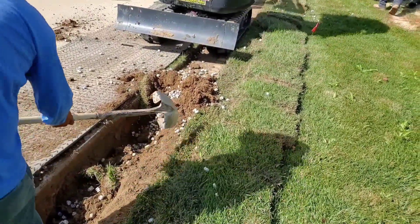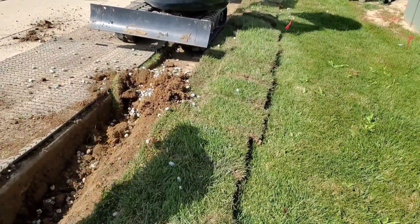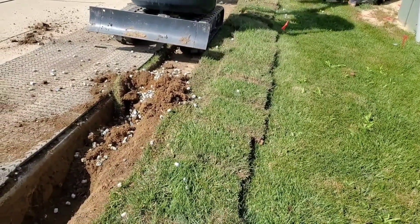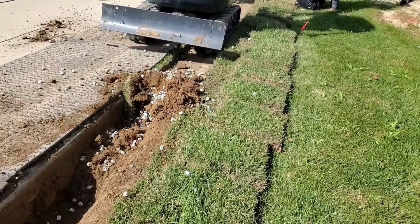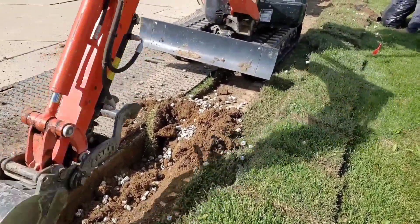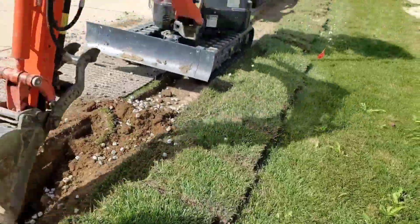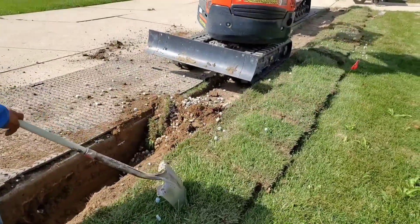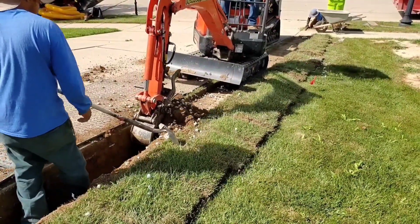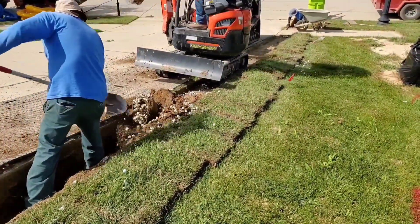We are replacing one of those peanut pipe styrofoam french drains. The homeowner had somebody put in catch basins with peanut pipe and it failed. I just wanted to explain a little bit why this failed - this was not the right product for this particular install. We don't use styrofoam peanut pipe no matter what. We believe in a real french drain, a true french drain, and that's gravel. What happens is when you put dirt on top of a styrofoam french drain, the weight of the dirt compresses the styrofoam and then you lose all your voids, so now you can't move water.